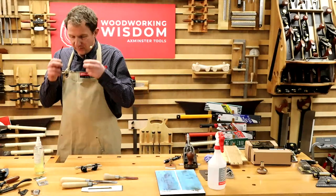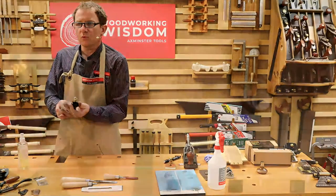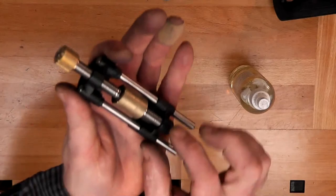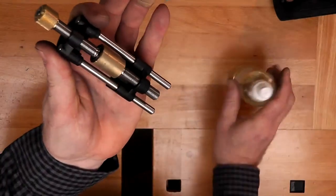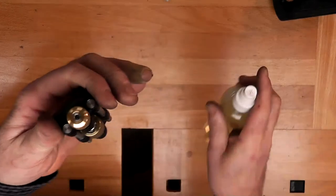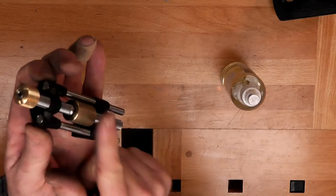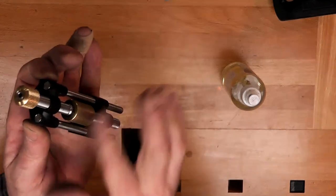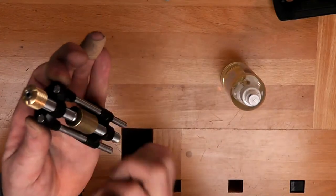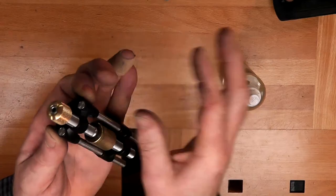While we're talking about that, Frederick, I've got to come back in. Got that roller. And one of the things they do say, you need to flush it with a light oil to clean it out. Now, ideally, I've done a couple of squirts. I'll turn the wheel by hand. That'll get the oil to run underneath. That helps. Do that once in a blue moon. Fantastic. Okay? If you're using it regularly, once a week, a little squirt of oil will be good.